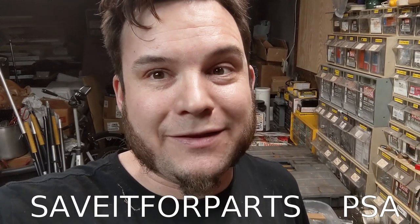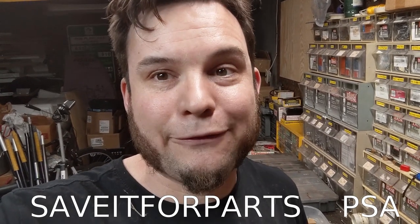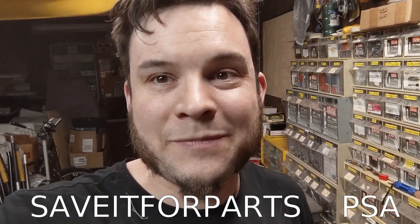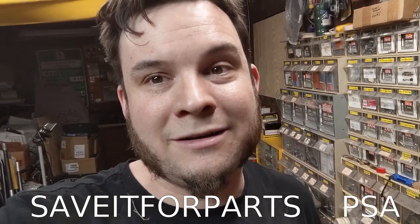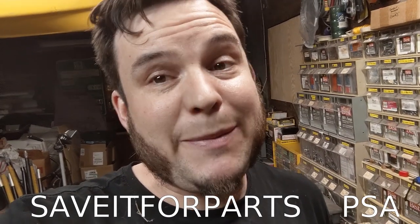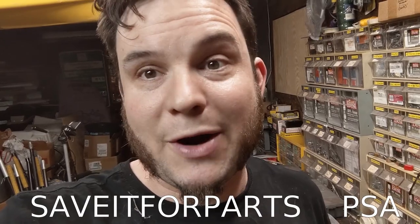A lot of people ignore the rot in the transoms of old boats like this. There was literally an article in the local Minnesota paper about one of these ripping in half when somebody throttled up their outboard — literally ripped the rear end of the boat off and almost drowned their entire family. So you don't want to let that go. If your transom is rotten, and it probably is if you've got a boat with any wood inside the fiberglass made before about 1990 — maybe even after — you want to dig into that, make sure it's solid, and if it's not, beef it up or rip it apart and redo it.